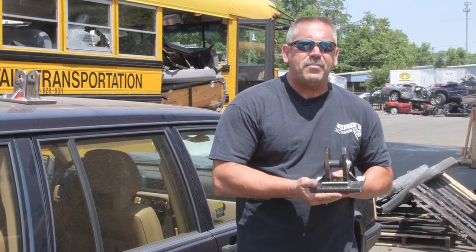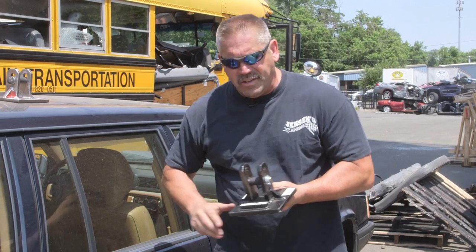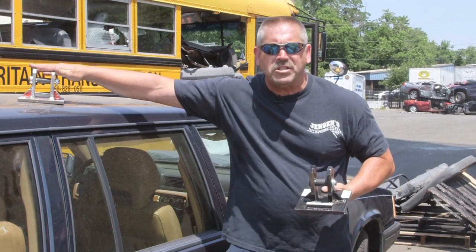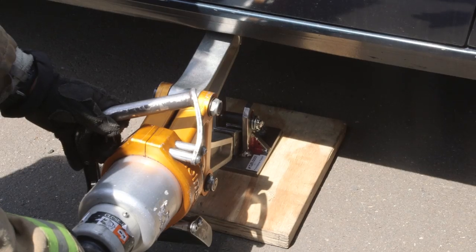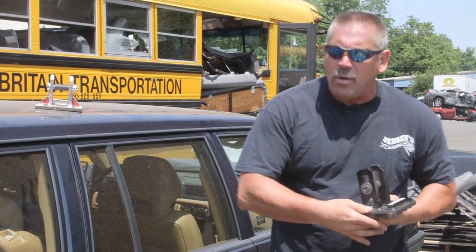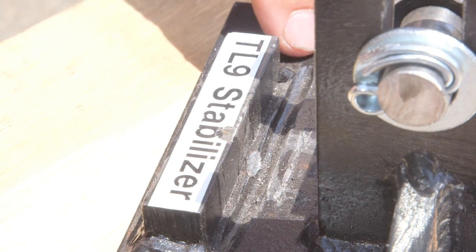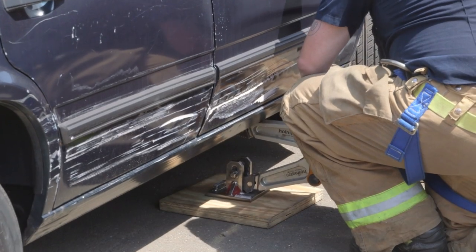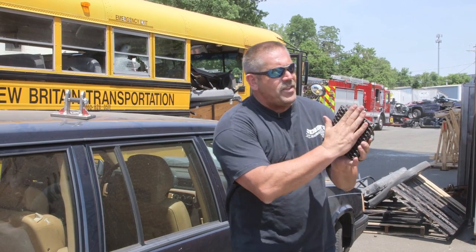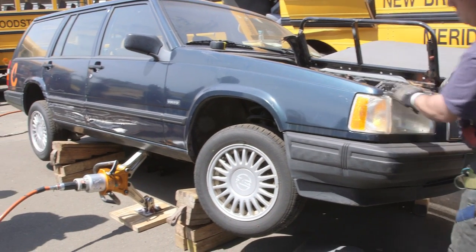What I have in my hand is the TL9 stabilizer specifically constructed for use with combination tools. The only difference is that the opening between the towers on the standard TL9 stabilizer is two and a quarter inches, while this one is one and five-eighths inches — covering the difference in tips between a regular spreader and a combination spreader. Both units also have a slot cut right behind the five-eighths inch stop pin, so as the jaw tips ride into the slot they're locked in place. The base plate will be stamped by the manufacturer on both units to provide anti-skid.